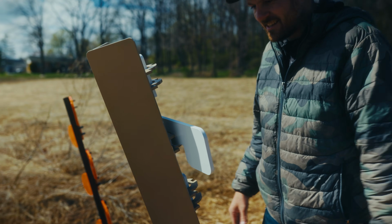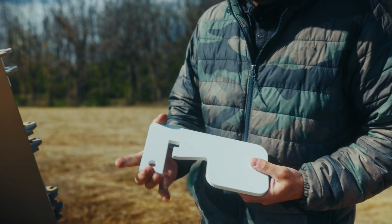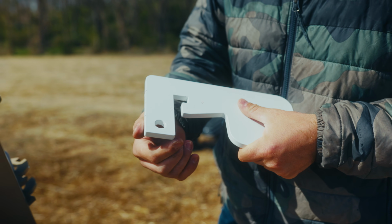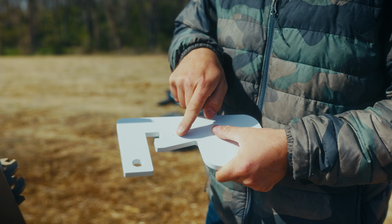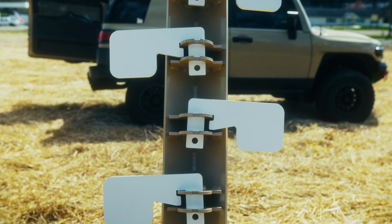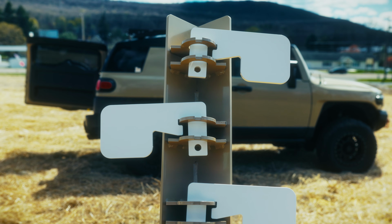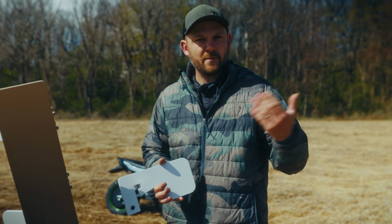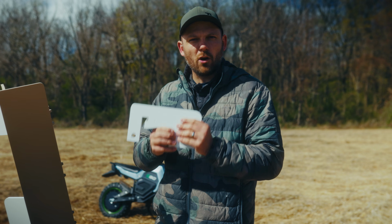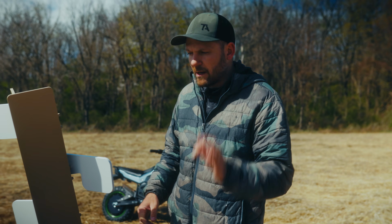We tested that extensively. When we talk about our paddles, look at how thick that leg is. I don't remember that dimension off the top of my head, but notice everything has a radius. See that? Even this gusset, it hits right here on the gusset, but everything has a radius on the paddle. And we do that to avoid the cracking and the chipping and the wear and tear. Now you could find the lifespan of this paddle if you abuse it or misuse it, but we sell replacements on our website. These paddles are AR 550. They are the amazing armor that you see in all of our armor piercing test videos. No joke, this stuff is incredible.